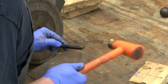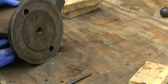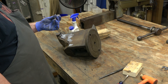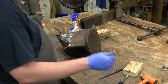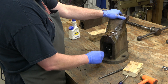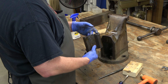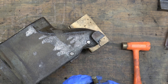We'll just tap that roll pin out of the base. Sometime between 1970 and 1972, they changed from a roll pin to a hardened steel dowel. Since Jordan has done his work there, that doesn't really help us in dating the vise. But there's your main vise nut - this one is hardened steel, but I have several vises that have cast iron main nuts inside them.